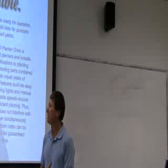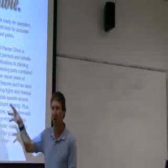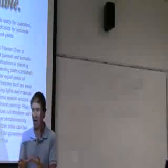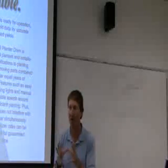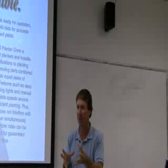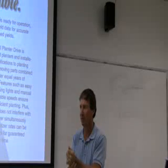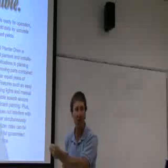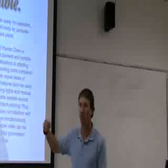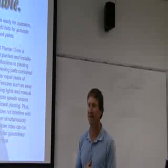But you can't connect a GPS right to this. This is not GPS. You have to have a map. And that map then defines what rate I want at different parts of the field. So the GPS actually goes into that map, just like we talked about before, determines the population rate at the location, and then sends that rate change command to this. And then this controls the hydraulic motor to put on the proper rate. That's how the system works.